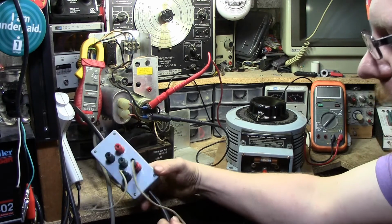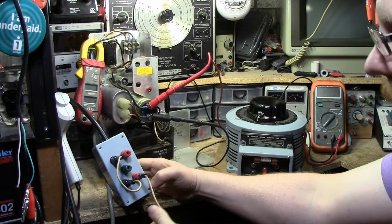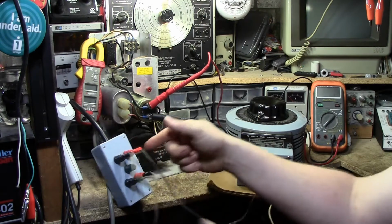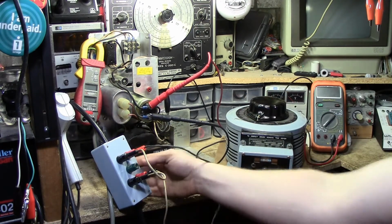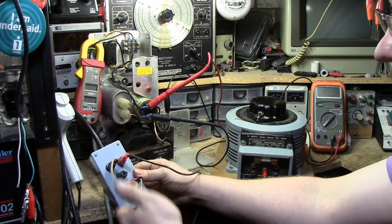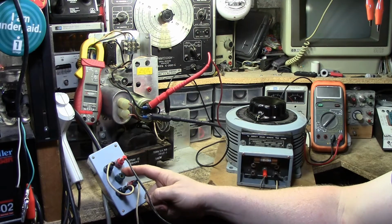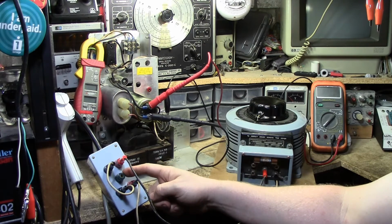To get to the output side of this, you just simply use a jumper banana plug. Or, in this situation here, I can actually tap in between here. This banana plug runs over here to my variac, which then runs back on this wire to the bottom side. Now the ground wire on this does not have the same thing. It always passes straight through with this green banana plug socket here, which is basically just a ground tap you can always work into.